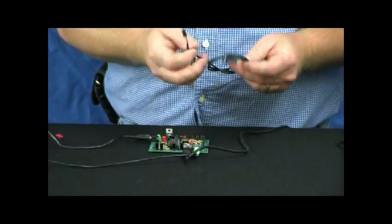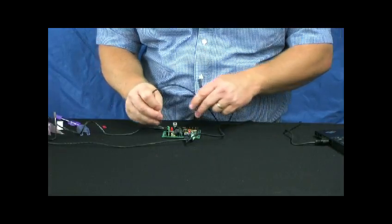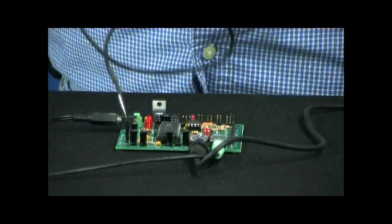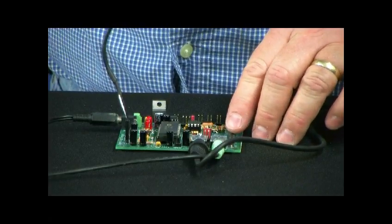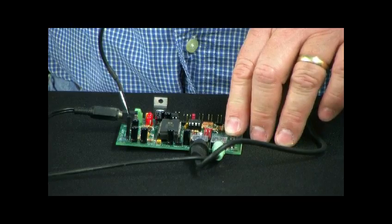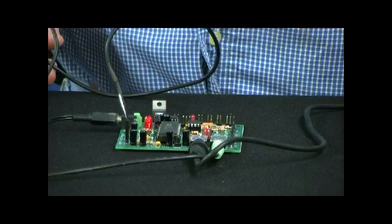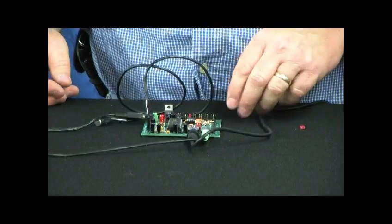Another option we have is the microphone, and I'll show how to record with it. This microphone comes on a two-foot cable — the white is the positive, so I'll plug that onto the board with the positive. I'll remove the mic-line red shorting jumper, so now I'm using the microphone. I'll turn off my speakers so I don't get feedback when I record. All I do is press record and speak into the microphone. It's very easy to record using the optional microphone. We now have three messages on this board that we could flip through.